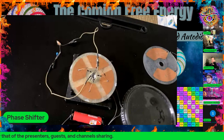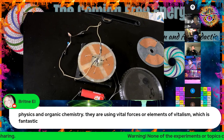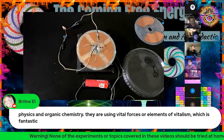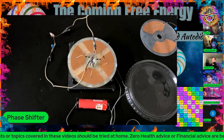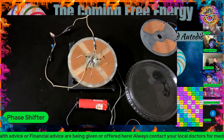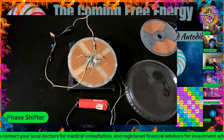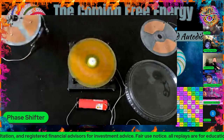And because my prime mover just natively draws, due to air currents and surface friction, about 76 milliamps in this example here, although the motor with no load draws about 10 milliamps, what I could effectively do is exchange that with an electrostatic motor and increase my spacing to get rid of the air currents, could even run it in a vacuum chamber, and we would end up with a system that was as efficient in rotating as it was in generating power. And since I don't see any kind of loading aspect between these two sides, I really want to find out what my exchange efficiency rate is.